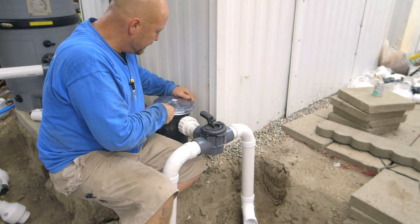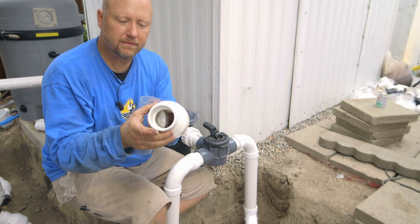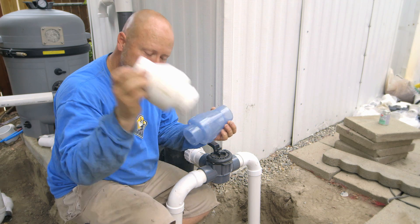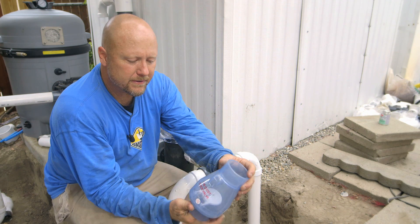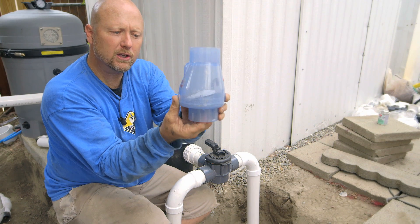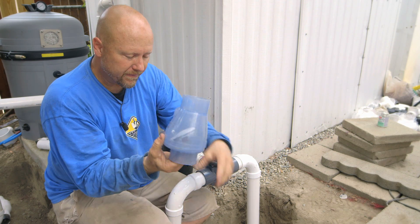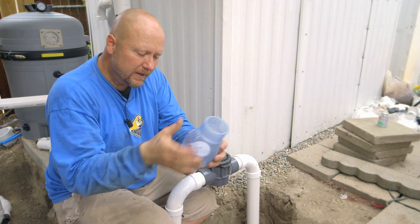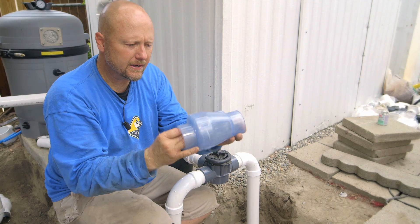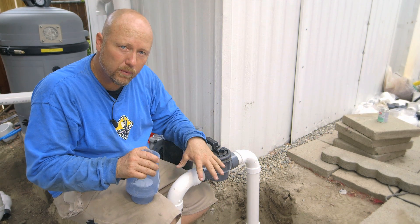Let me show you an example of the one-way valve. There's a valve inside — it's a flapper valve. It's really loose — you can hear it bounce up and down. I brought this clear one to show you the flapper inside. This other one is spring-loaded. I typically don't use the spring-loaded because it takes more power for your pump to push that spring open. The flapper valve is very easy to push open and it's also very easy to keep the water in the line. I hope that explains the flooded suction and how we're going to prime this with the one-way valves.